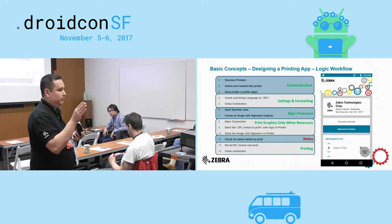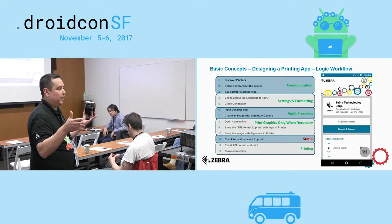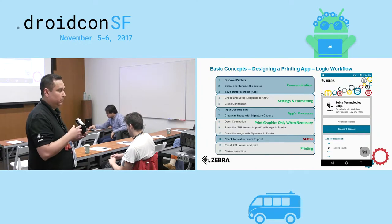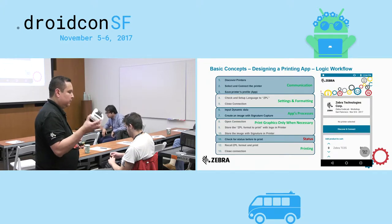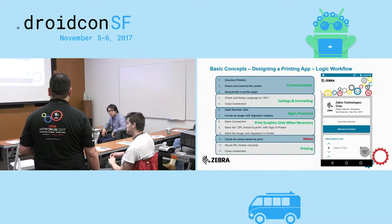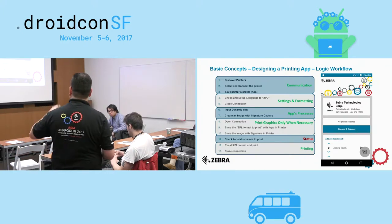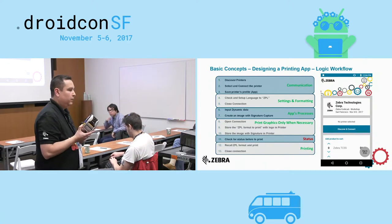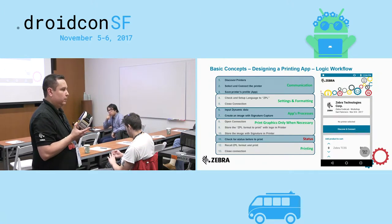So with the same data, the difference is the type of package. In one package, you're sending all of the data in Bluetooth standard, against 10, 20 packets in Bluetooth low energy sending the same data. So this is one of the differences when working with Bluetooth low energy, and how we solve that issue is using templates. Basically, our printers can save all of the template information in the printer.